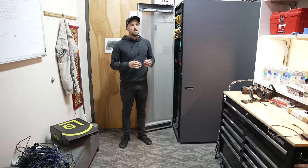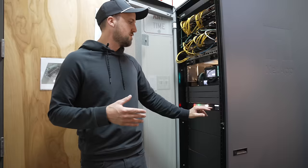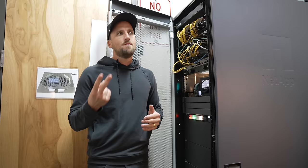Let's work our way backwards starting from the LED wall and processor. We have an SDI cable that runs all the way back here to our video switcher, which is the ATEM Constellation 2ME. This functions as our switcher with two MEs — one for live stream, one for screens in the room — and it also functions as our video hub. Once a video signal gets to the switcher and we have that run going to the LED wall, we can output pretty much any video signal source we have to that wall.